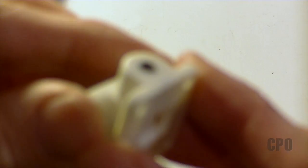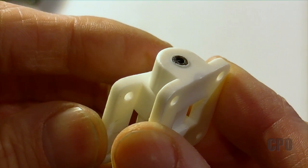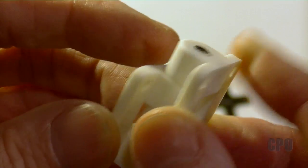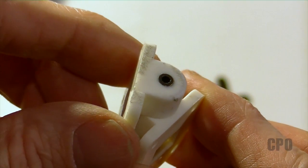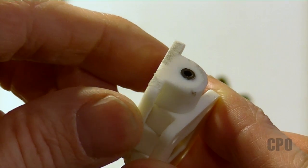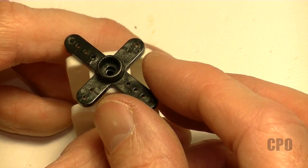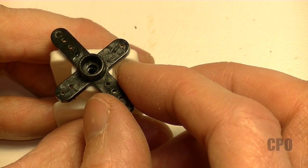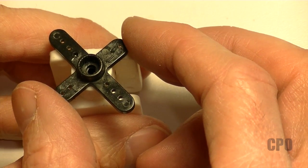Just like David, I decided to glue the servo arm onto the assembly before trying to screw it. As you can see, one side of the carbon fiber tube will rotate freely in the assembly and the other won't, so just make sure you don't accidentally glue the rotating side together during this process. This is probably the most critical step in the entire assembly — make sure that the center of your servo arm is exactly over the center of your pivot point on the assembly.